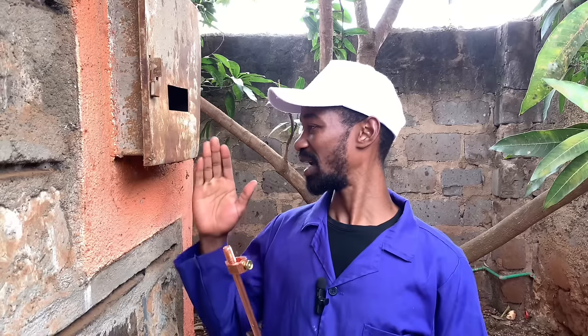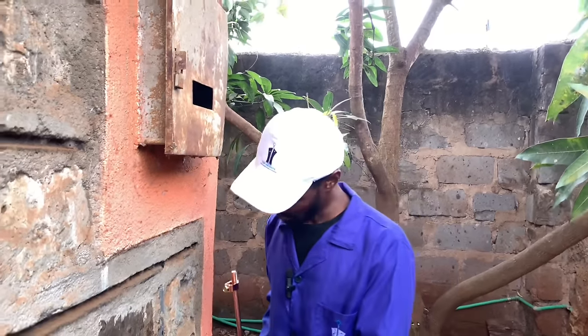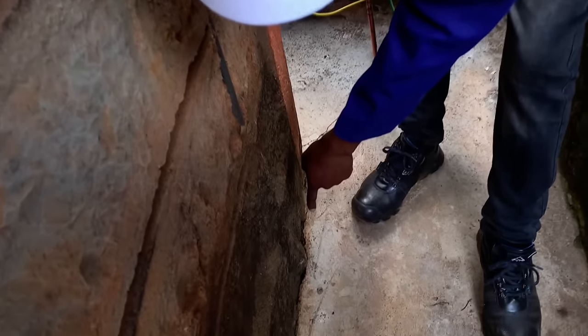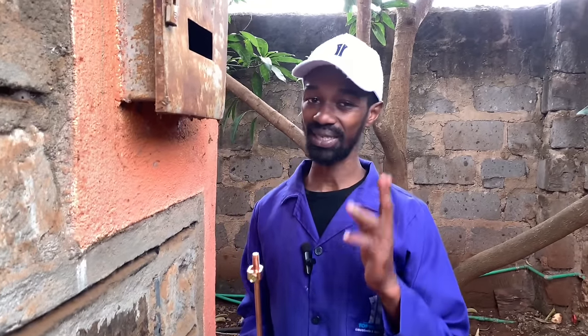Today we are learning a lot concerning this aspect. I have this meter box here — my client asked me to check the earthing system, which had an issue. I want to upgrade it. We already have an earthing system for this house using this pipe here. There is an earth connection below and an earth rod that was immersed in the ground, but my guess is that this ground has probably failed in terms of conductivity.